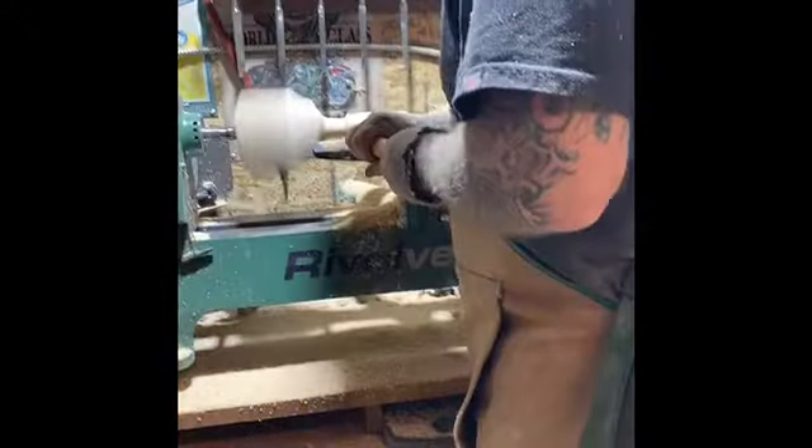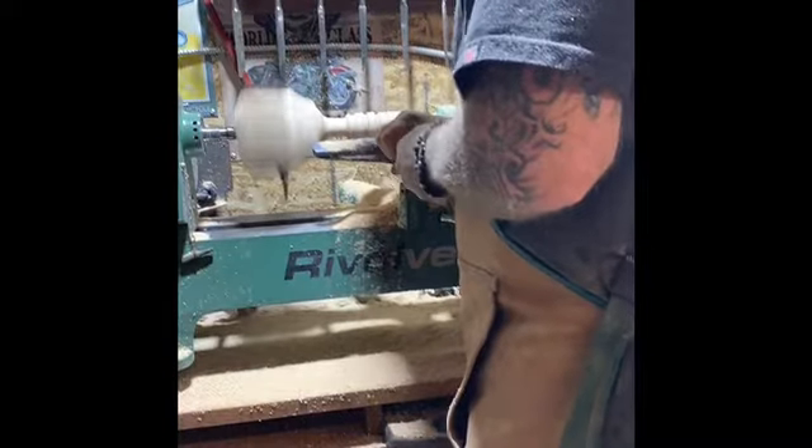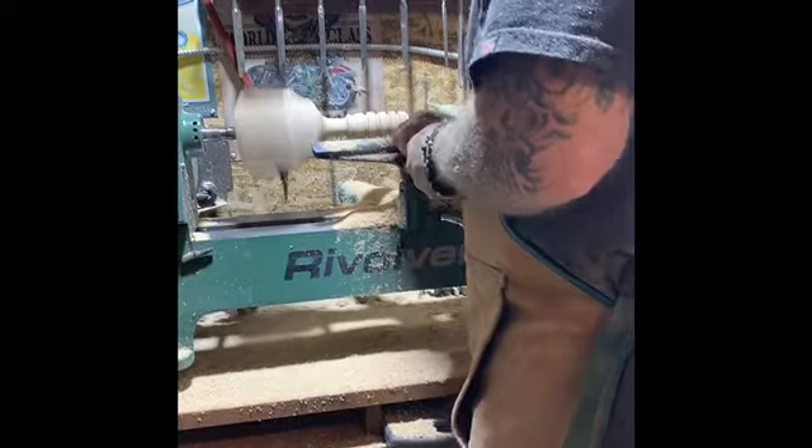The next step is to turn the throat of your handle above the grip down to about an inch and a quarter, right out to about an inch and a half below where the head tapers out. This should give you an indication of the shape I'm talking about — take your time and go slowly. The exact shape and dimension isn't really that critical; the whole point is you're just leaving some extra mass to keep the weight up in the mallet head. Find something that's aesthetically pleasing but still structurally strong.